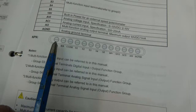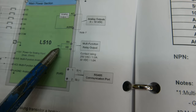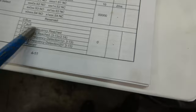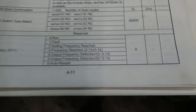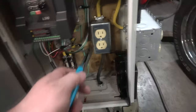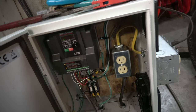These two terminals here are for the relay — I think there's only one relay in this device. It's set to normally open right now at setting 0. If I set this to setting 1, when I power up that inverter, that relay kicks on. This would be a different job, but I could add a relay to carry the current for this 120-volt two-wire circuit. Whenever this VFD is powered on, it would power on all that stuff.